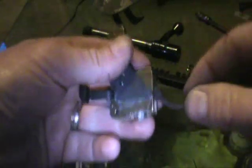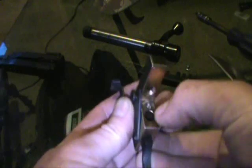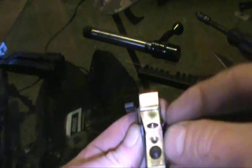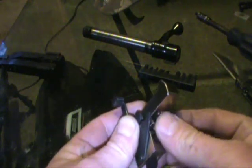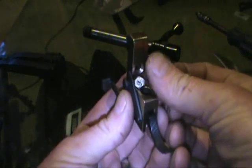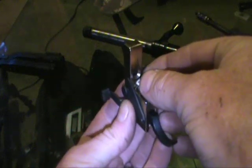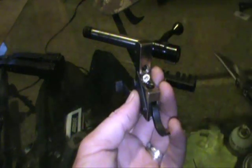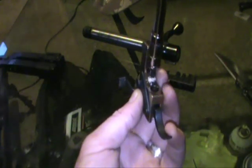The safety is pivoting, everything's there, but you'll notice there's no resistance on pulling the trigger - it's real sloppy and loose. That's because the spring is not in yet. I cut one round off of this spring and I'm not a hundred percent sure that was absolutely necessary, but I did. So we put the spring in there and we put the little pointed threaded stud in right behind it - and it falls out. That's just how it usually works out, three or four times evidently.